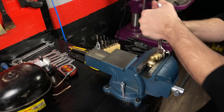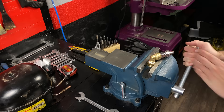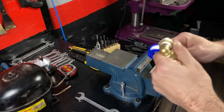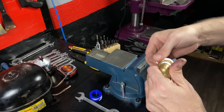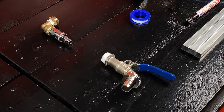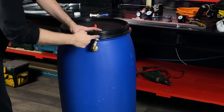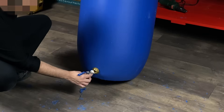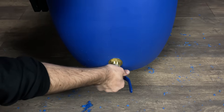With this quick coupling valve, we will be able to quickly connect the gas extraction hose to our barrel. Here are the two pieces ready that we are going to install in the barrel. At the top, we fix the quick connection valve, and at the bottom, the waste drain tap. We put it tilted to one side to be able to connect a hose.